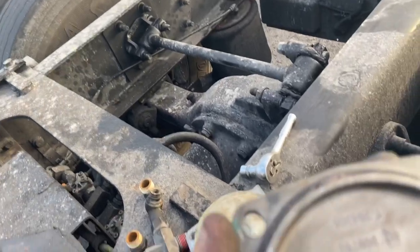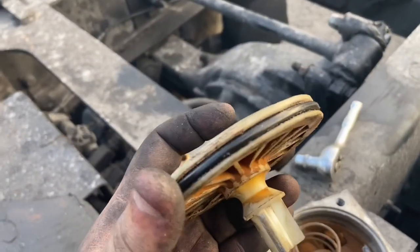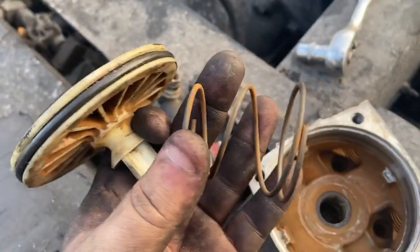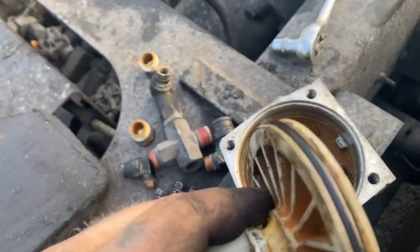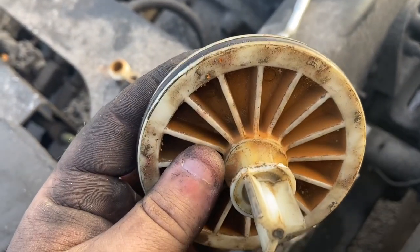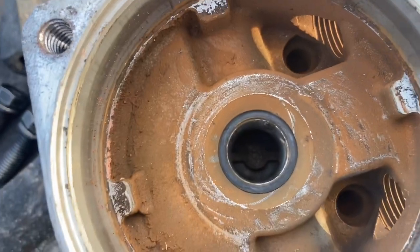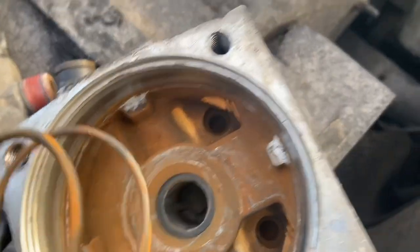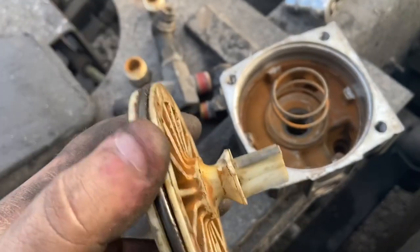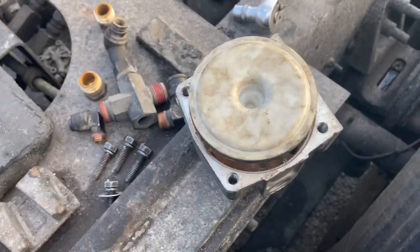The ring's not bad — that's not a problem. There's a plunger that goes down right there in that hole and that seals it from the exhaust. So we have found our malfunction — like I thought, internal damage. This one we cannot rebuild unless we replace this plunger, but I don't believe you can just buy the plunger separately.